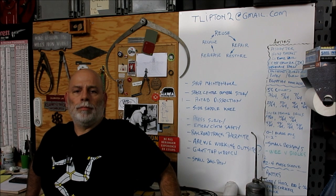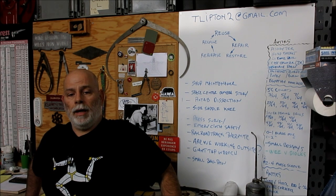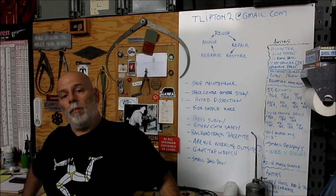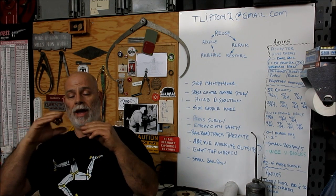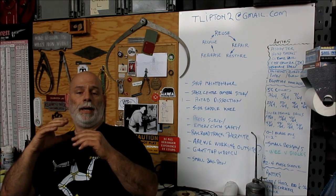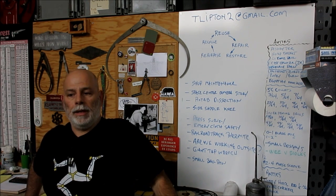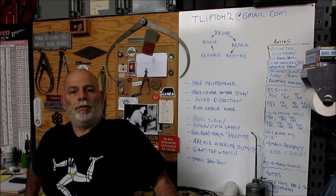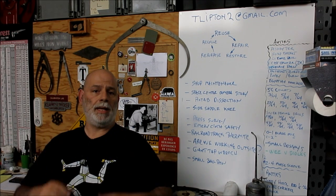There are some problems with setting up and cutting these tapers — they have to be very precise to meet book specifications. It doesn't take much to be off in angle or in diameter, and it drastically affects how the mating part fits. That's why this is of interest to the metalworking community: it's not simple. There are books written on this and whole tolerance systems to quantify different grades of tapers and mating fits.